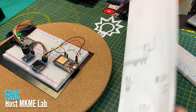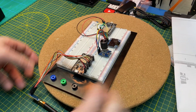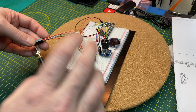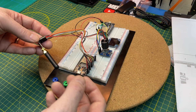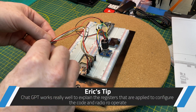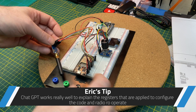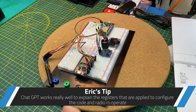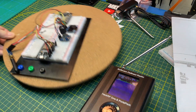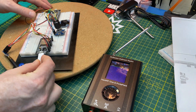Done some checking in the code — I checked all the registers that the ESP sets on the radio, or actually I just checked the frequency and power. ChatGPT was able to tell me what the registers were. It is set to the correct frequency, 433.9MHz, and I modified the code to send a wake-up command to the heater. This is the result.